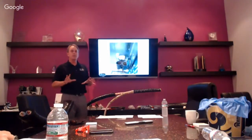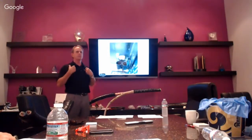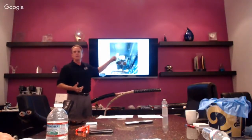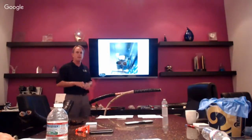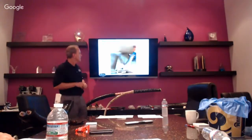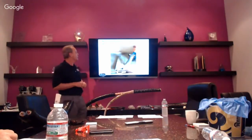Yeah, it needs a 115 volt. So designers, reps, specifiers have to do a better job of indicating a 115 outlet. You can bury it in the panel. I mean, walk-in manufacturers will do that. Wherever we decide to, be tucked, over here's a good spot, 18 inches off the floor. Then we got the oops, missed it by that much. Like that never happens.